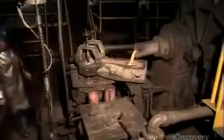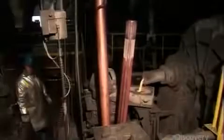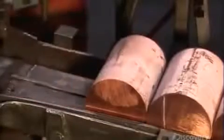The copper flows into a casting furnace. It generates copper rods that are about the size of a telephone pole. Each one weighs about a ton, so it takes a crane to move it down the production line. A circular saw then carves them up, producing copper chunks that look a bit like firewood. They heat each chunk in a furnace to make it more pliable.